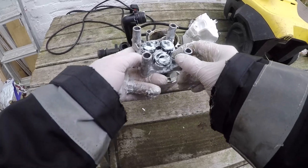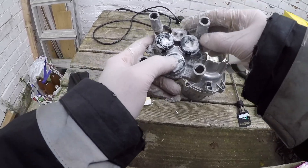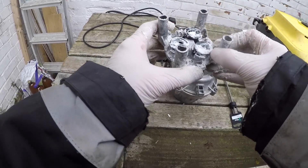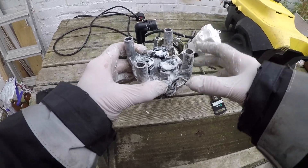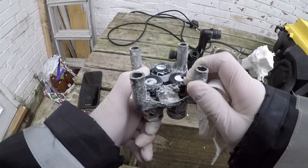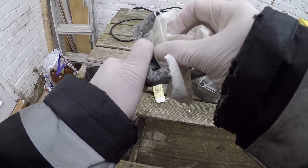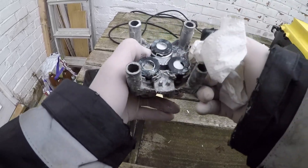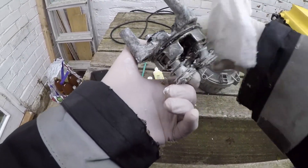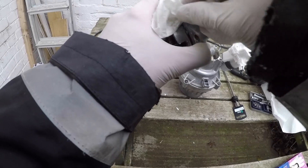Obviously I don't think you want any grease in the actual chamber itself. Another top tip: if you want to know which way around to locate this on the body, these two prongs sticking up are the ones that align — that's what the switch unit sits into. I'm going to take these gloves off and get some kitchen roll. I'm going to go piston by piston and just wipe the grease off the top of each one — the chamber must be full of water, not grease — and wipe the excess off the top of the casing so the next person who takes it apart won't curse my name.